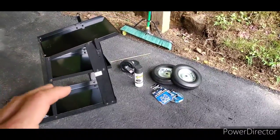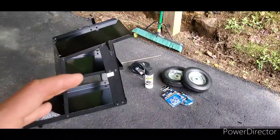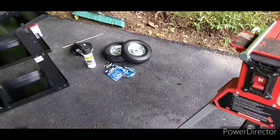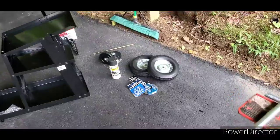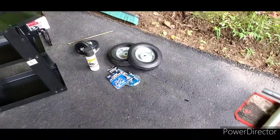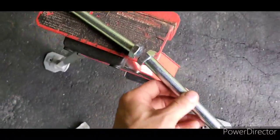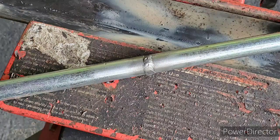A good example of that is basically what you see here today. This is a Harbor Freight cheap welding cart. I saw a neat mod video on how to get more out of it — this thing is less than $30 on sale. The project called for a piece of all-thread to make a new axle for these wheels that have bearings in them. We're gonna make our axle by joining some bolts together, eliminating the head, aligning them properly, welding them in, and also welding on some hooks and a handle to pull this thing around with.